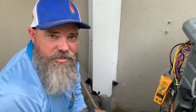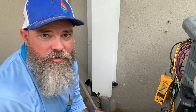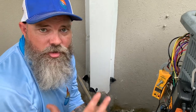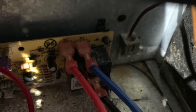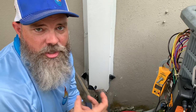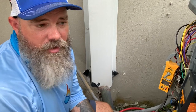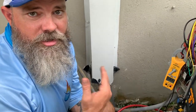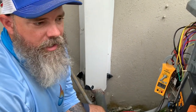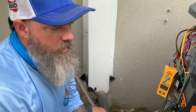So I had to get into this system a little bit more. It looks like the heat strips were actually engaged all the time. I looked at the circuit board in the air handler — the fan control board — and it was corroded. When I disengaged the low voltage to the heat relay, it was on all the time. It must have been melted shut inside. So it looks like the circuit board went bad first. Somebody thought the unit was low on charge and charged it, then changed the fan motor — but it wasn't the fan motor, it was probably the fan control board, and that fan control board caused the heat strips to go on all the time.